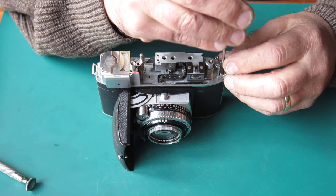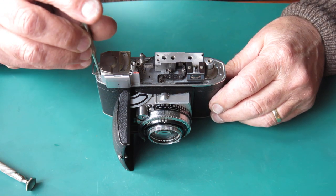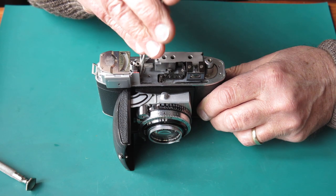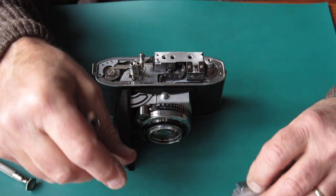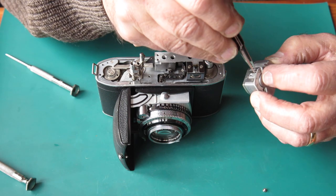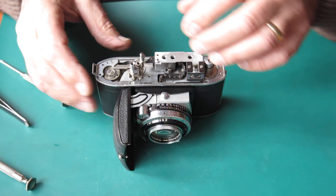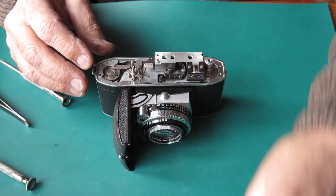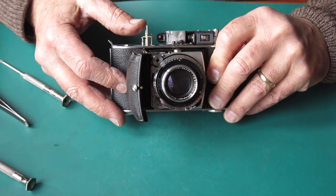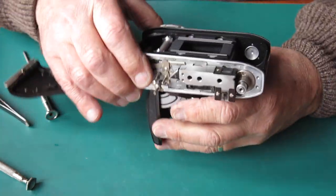The strap lugs have the ends a little bit bent, but that's not uncommon. I'll take that screw out of the meter — there should be one here too — and sort these bits into containers for cleaning. The meter responds to light, which is good. Let's check: is there a problem with the shutter release? Nothing apparently wrong there. I think I'll remove the lens and shutter assembly from the camera.